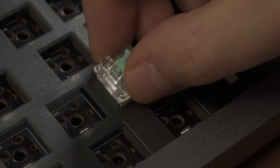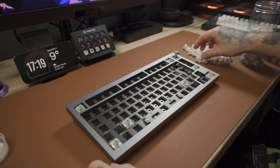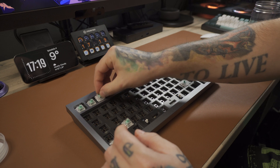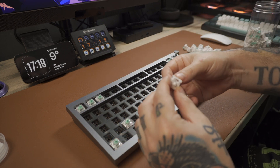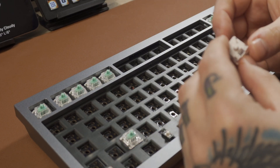Okay, that was a whole lot of information but I promise now we're onto the easy part — actually building the keyboard. It's nowhere near as scary as it sounds. Basically all we need to do is install the switches and put the keycaps on. The switches are probably the slightly trickier part, but it's really okay once you've done a couple. Essentially all you have to do is line them up and press them in. You're probably going to have spare switches so don't worry too much if you mess anything up. Look at the little sockets on the PCB — hold the switch as straight as possible and push it straight down until it clips into the plate. I tend to find a rolling action starting from the side where the two brass pins are works well, but you'll figure it out — there's a bit of a feel to it.